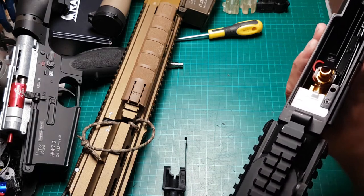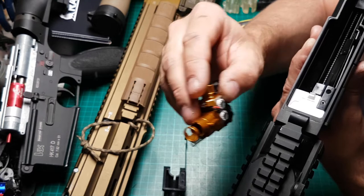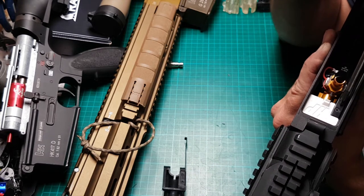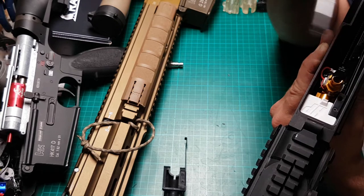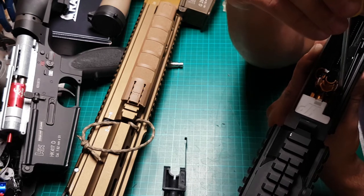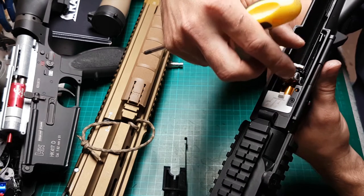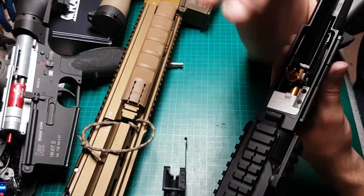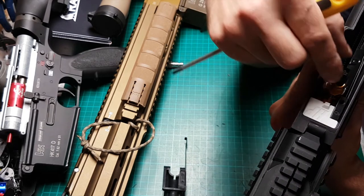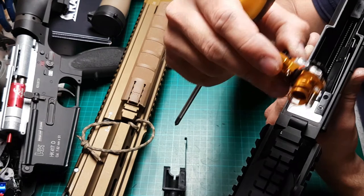It's very simple, but you have to remember about this tracer unit. The right side of the tracer unit is a bit too big to fit into this chamber without collision with this metal plate. So there are two solutions: you dremel out this excess of the metal part, or you install a mirror or aluminum foil as a reflection of the LEDs — without the LEDs. Without LEDs everything is smooth, everything is fine, and there is no problem, no collisions. So you have to remember this if you want to install the tracer unit.